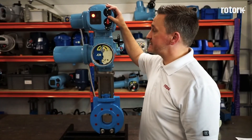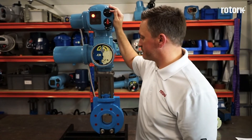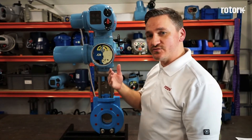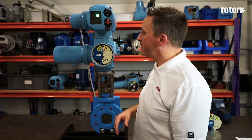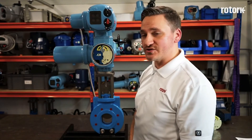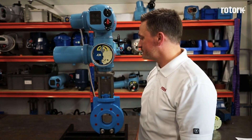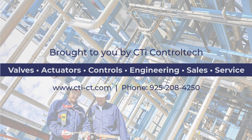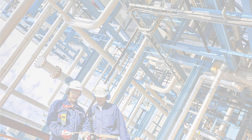The actuator now has its limits set and is available for electrical operation. Once the limits are set it is always a good idea to run the actuator up and down a couple of times just to ensure it is operating as desired and the torque values set are sufficient to operate the valve. Thanks for watching this CK mechanical switch mechanism commissioning video. We hope you find it useful and be sure to check back soon for future videos on the CK. We'll see you next time.